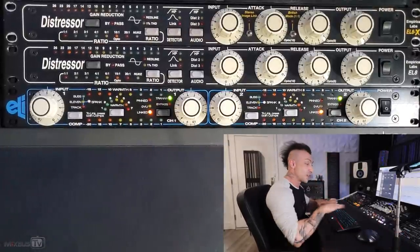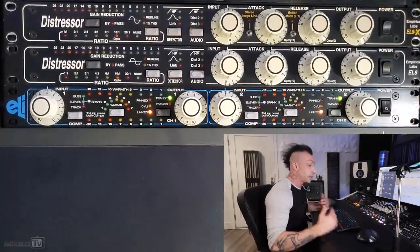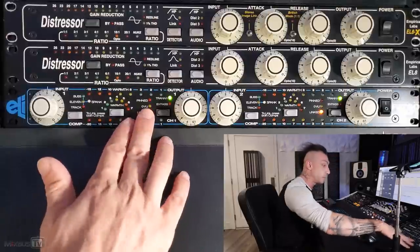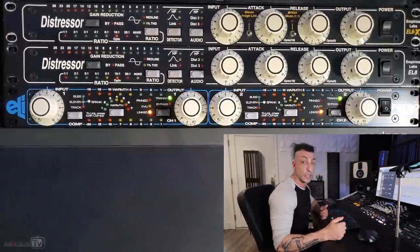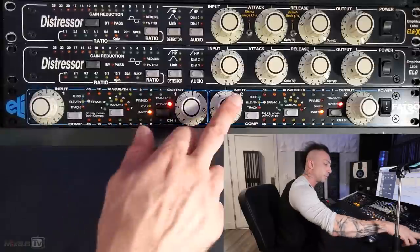First pass, just passing these drums through the FATSO. You can hear I level matched, and what you hear is not level increase, it's just harmonic content. Just passing through it, you could hear the VU meter lighting and the pinned LED lighting up on the snare, so we are in the sweet spot, and you could hear the difference with and without transformer. Let's start to drive this hard, pushing the input up to 9.